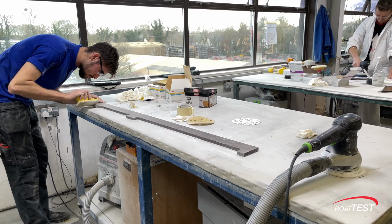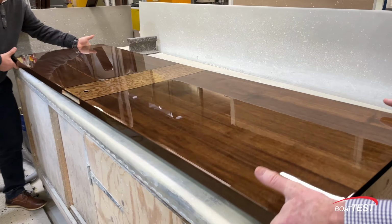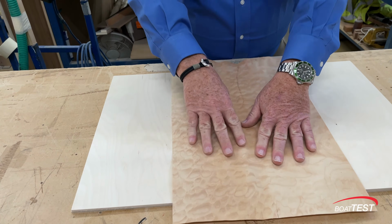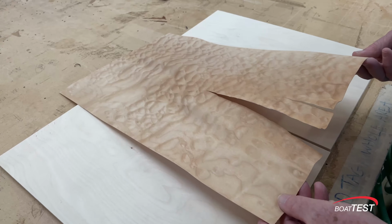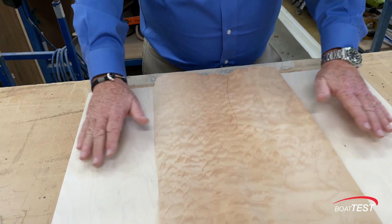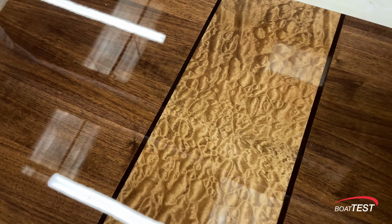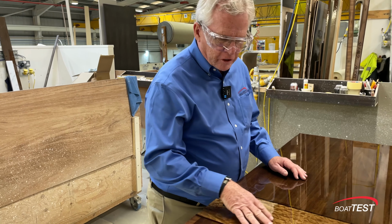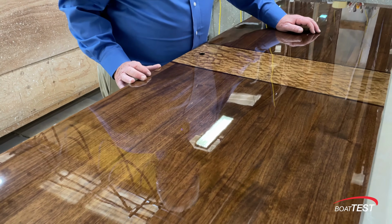The maple inlay that we see on the walnut coffee tables and the backs of the doors on Fairline Yachts, it's a difficult process to do, and it takes a piece of laminate that is so fragile. It's got to be put down just right, because if you press it just wrong, you end up with it ripping, tearing, creasing. When it dries out, it becomes even more hard, so they have to get it from the manufacturer kept wet so that it's workable. The trouble that they go through is clearly worth the effort, and the end result is such a nice reflection on Fairline.